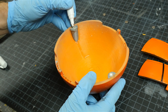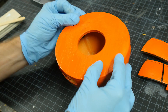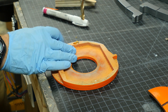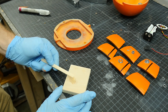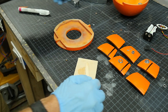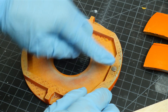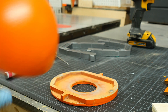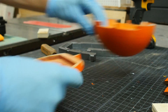The magnets fit alright, but not as well as they would have if I had modeled the correct depth for them to sit in — it would have been sitting on a flat bottom and perfectly flat on the top edge. I put a dot of white paint right in the center of both magnets, then set on the mating piece. When I pushed down just barely, it transferred some of that paint to the mating piece so I knew where the center of those holes should be. I followed the same process and drilled really shallow holes, but this time I mixed up a two-part epoxy. This mixes up thicker, with the idea that it would fill some of the gap and make it easier to place the magnets at the right depth. It actually ended up working quite a bit better — I had to wait a couple minutes for it to dry, but then it was ready to go. I tested the piece, and even though they didn't lay perfectly flat against each other, they lined up really well.